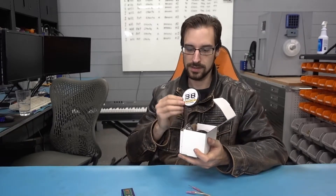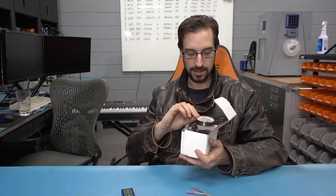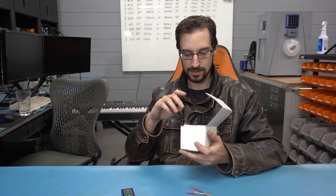I find it really handy to keep a whole plethora of different sizes of resistance wire. Some of this is Kanthal, and some of this is Nichrome wire, and I make all kinds of resistors based on these. The basic concept is that we'll have a power source and a switch, and that power source is going to run current through a resistor, which will heat up until it gets red hot, and hopefully that will light our sugar rocket fuel.